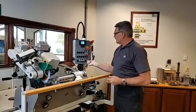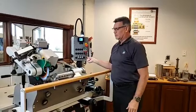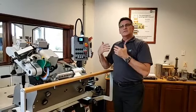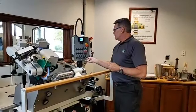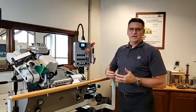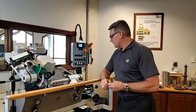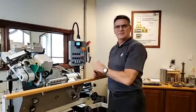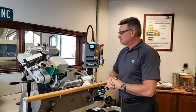So now we go in and there's a separate frequency inverter that's driving the RPMs of the spindle itself, or the wheel. So as the wheel gets smaller, we have to create a higher rim speed to do the same amount of cutting as we would with a much larger or full-size wheel. And depending on the type of wheel itself too, that's going to allow us to set a different range of cutting, just due to the compounds of the wheel itself. And then some folks like myself are pretty aggressive, so I run a high RPM and really cram the knife steel in there. So others don't. So that lets everybody be flexible.